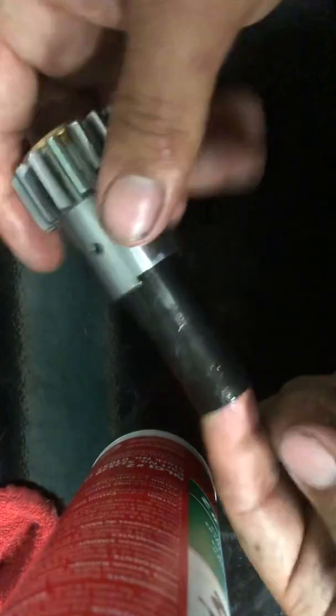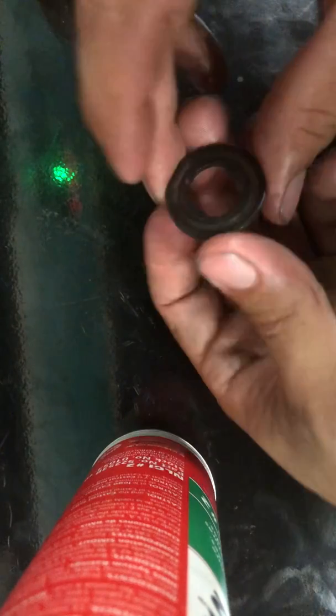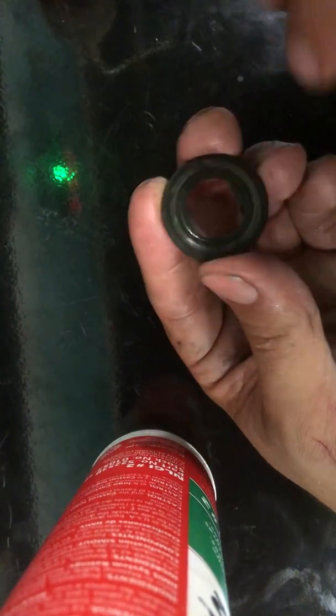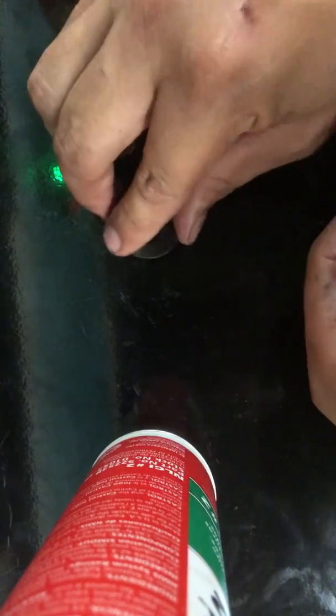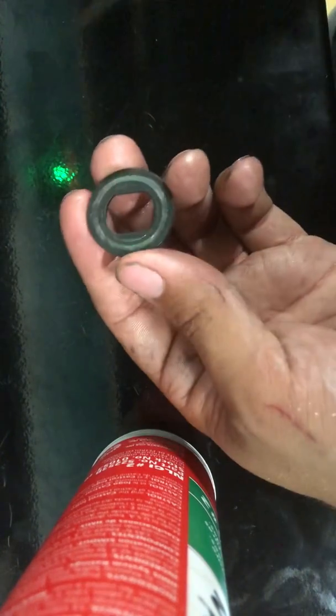And then go ahead and slide that pinion back in there. Now with the thrust washer, you can tell which side engages up against the face of the pinion, because it's got this wear on it. As that gets worse, this surface will get kind of rough, and I'll usually take some sandpaper and just run it around on some sandpaper and clean up the edge.